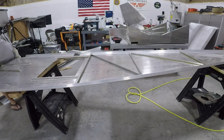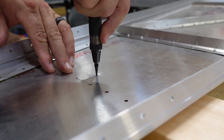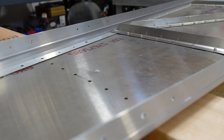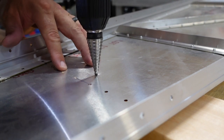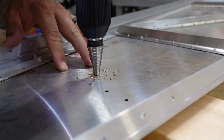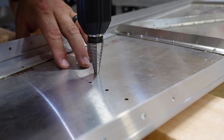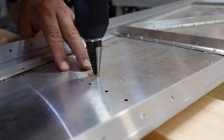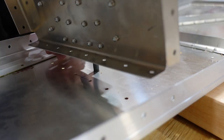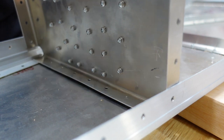Here we're flipping over the bottom fuselage after doing that final riveting on the bottom. Now I'm going to center-punch the tail skid eyelet — there's a small bolt that goes through the bottom skid for a tie-down, and the skin is not pre-drilled for that. I measured the bolt size with a micrometer and matched it to my step drill, took it to the third notch, and it was a perfect fit. I have a two-by-four underneath so we don't flare out the aluminum skin on the bottom — gives us something solid to drill against. Test fit was perfect.